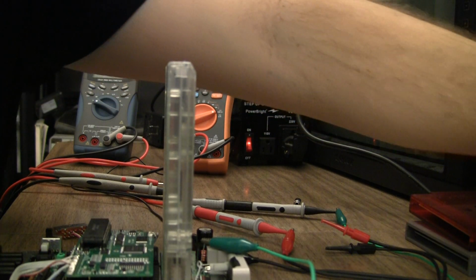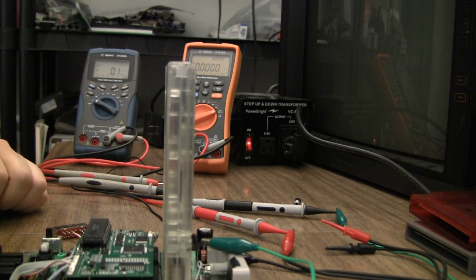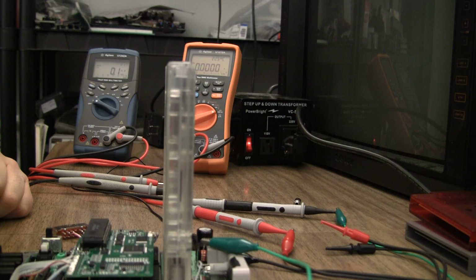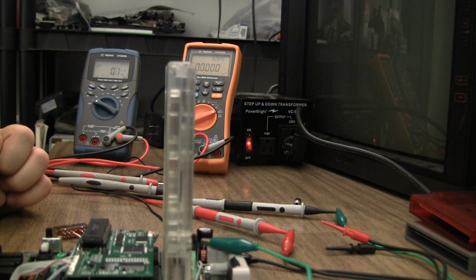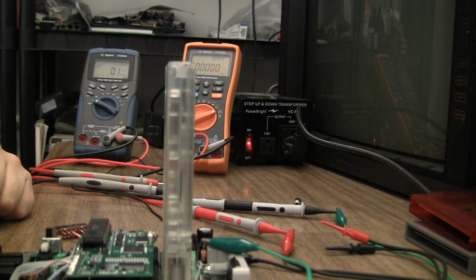The other thing that I kind of wanted to try, but now that I've had to do all this business, that's just not really going to happen, was we could even try to put a low dropout regulator in there and feed it less voltage. Less voltage means less heat generated. And for the most part, most people aren't going to want to go through all that hassle. And now that I know it's really only using about 600 milliamps, I don't think it's going to be worth all the hassle to do such a thing. But I don't know. So far, we're in good shape.